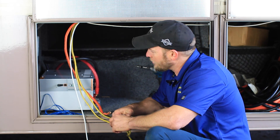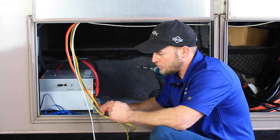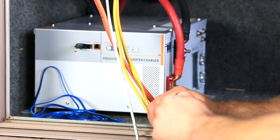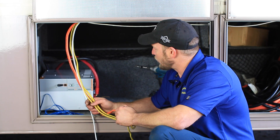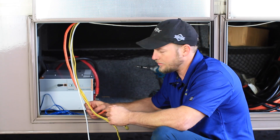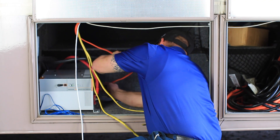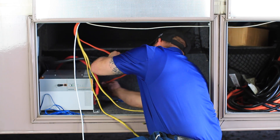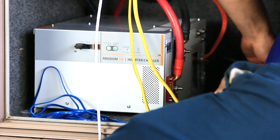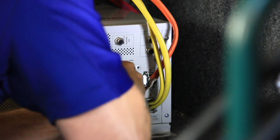Okay, so now we're going to go ahead and make our AC connections. This is number 10 Romex. This is going to be our 30 amp supply to the inverter charger. This will do when you're plugged into shore power — it provides the 110 volts AC via the pass-through transfer switch. So we'll power the downstream loads through the inverter and it will also provide the 120 volts AC to the inverter to charge the batteries when it's in its charge mode.